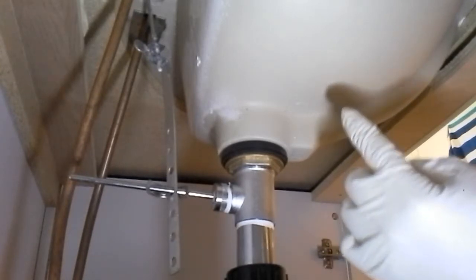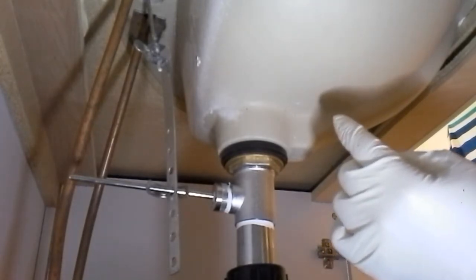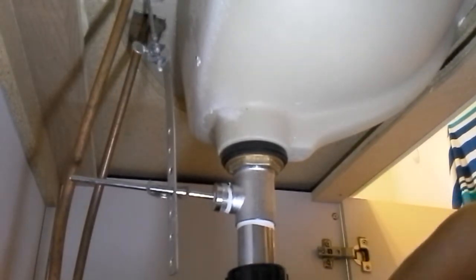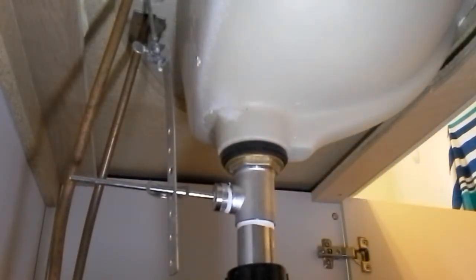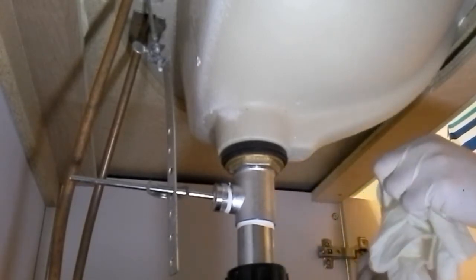Go back upstairs inside the sink. Remove all the putty. Take a toothpick. It was the tip to minimize any putty that's visible. Fill it with water. Come back down here. Pop the sink and look for any leakage. If there's no leakage, you're good. If there's leakage, finger tighten. So let's unlock. If any leakage, it would be right around here. But we won't know until we dry off everything, remove the putty, and do the test. And double gloves. Why? Because you don't want to work with dirty hands.